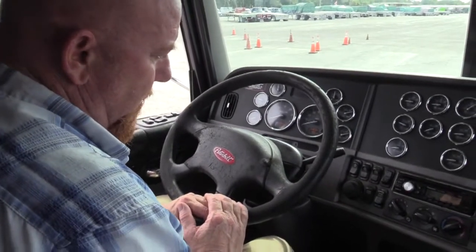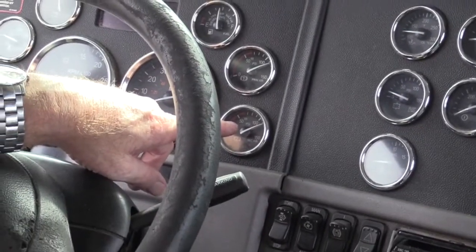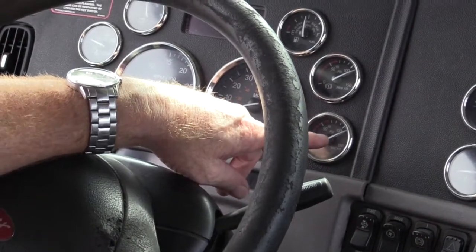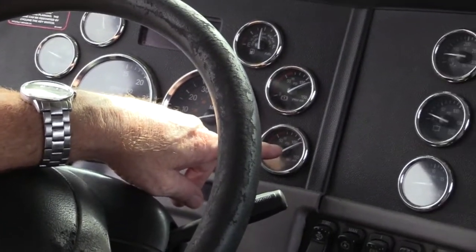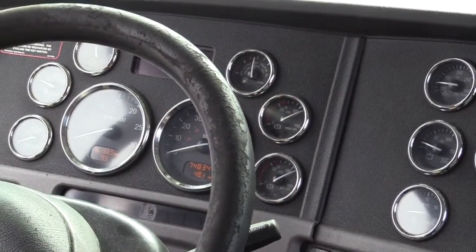Okay, so I'm mashing the brake now. See, I moved. That's because air is traveling from the tank through the service line to all your chambers right now. So it takes air to do that. See how it just stabilized? Had you started your 60 seconds when you first hit the pedal, the examiner would not have started theirs. You will not have held yours for 1 minute if you don't do this. So it stabilized and now I'll hold it for 1 minute.